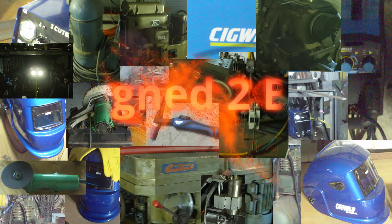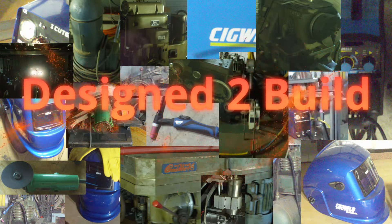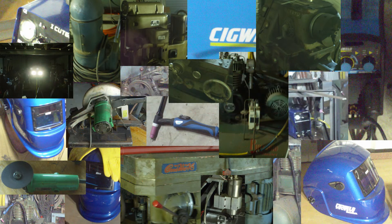Hey YouTubers, some of you may have seen a video I put up a little while ago about making a reef anchor. Well, that didn't go as well as I'd hoped because the reef anchor was way too heavy. I should have done my arithmetic before I built the anchor instead of just eyeballing it. The one I built was too heavy for the plate — it actually pulled the plate under and kept it considerably under. So I'm redoing the anchor, making it much lighter, and this time I've done my sums and worked out how heavy the anchor should be to keep the plate on top of the water.